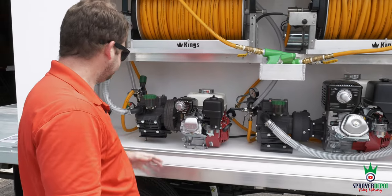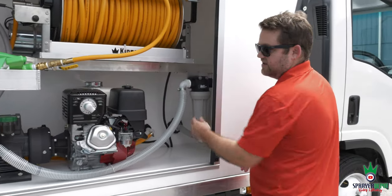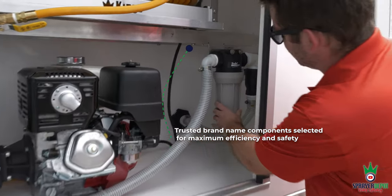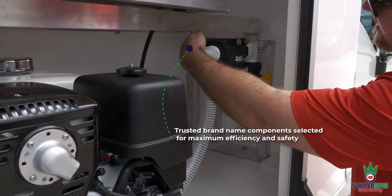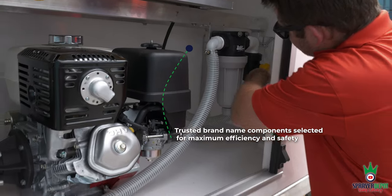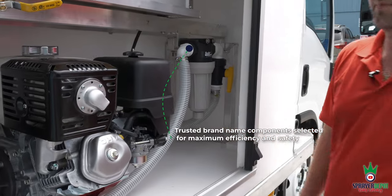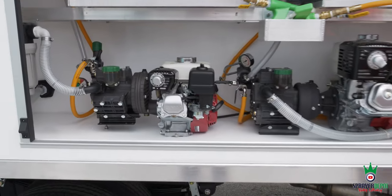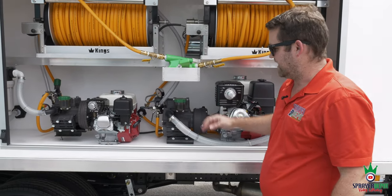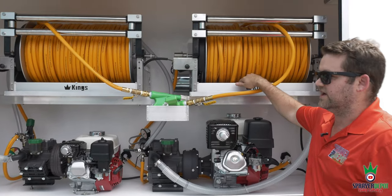We also use high-quality TeeJet Technologies strainers — a leader in agriculture and landscaping spray tips. We're using their A-126 strainers with nice big mounting lugs, a custom mounting bracket, and an on/off valve. So if you need to clean your filter, shut off the valve, pull off the bottom, clean it out, and open it back up so you don't run the pump dry. To recap: 390 electric start, Delta 75, Kappa 75, 160 electric start, Kappa 55, dual 22-inch electric Kings reels with stainless internals, 400-foot half-inch hose, Foster reusable fittings, Foster quick-disconnect, and ball valve.